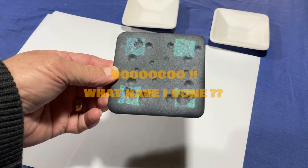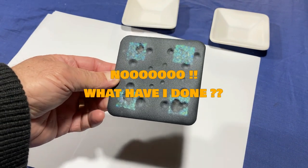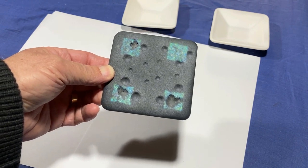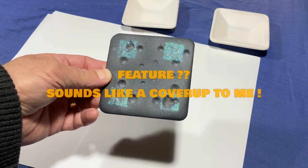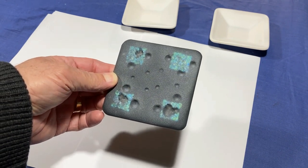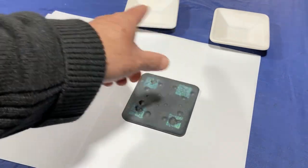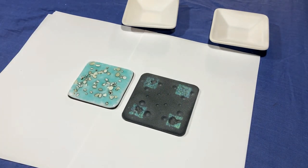Prepare yourself — this is what we're actually going to be slumping. A lot of the bubbles were just too close to the surface, so I ended up grinding them out. So I didn't have any undercuts, I've ground them out fairly well and I think I've got rid of most of them — we made a feature of it. How it's actually going to look once it's slumped is going to be a surprise. I've got my moulds up here, all sprayed with boron nitride. I'll wait a little while for them to dry and then we'll get them in the kiln and we'll see how they turn out tomorrow morning.